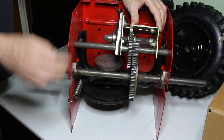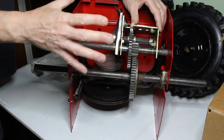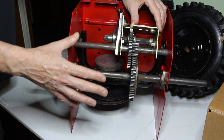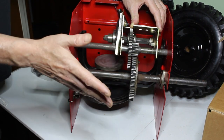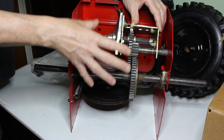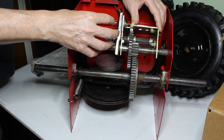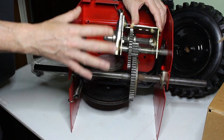If you're getting slippage on your snowblower — I like these systems over the cheaper gearboxes that are plastic, which you'll find in a lot of Craftsman and MTD machines. All these gears are very solid metal. With the plastic housing ones, similar to the transmissions used in lawn mowers, you're going to have a brass gear in there, and what happens is they shred up.